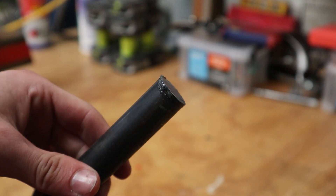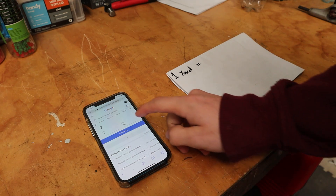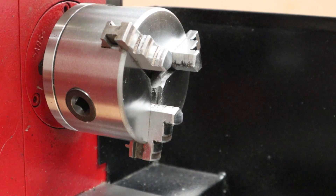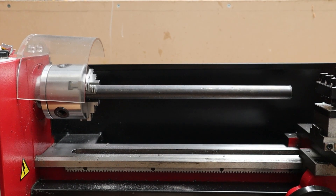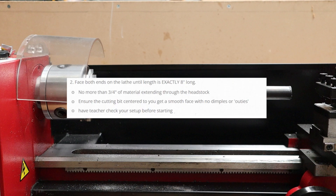It's time to get cracking on the build. The first step is to grab the piece cut down to about 205mm long. The second step is to face both ends until it's exactly 200mm long, and this is where I ran into my first problem. The 20mm stock is too wide to fit in the chuck properly, so it sticks out a lot and wobbles around, which goes completely against the notes saying no more than 19mm extending from the headstock and checking your tool is centred. But let's have a crack anyway.